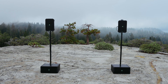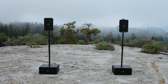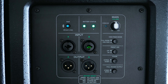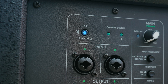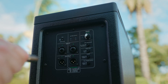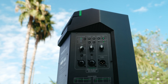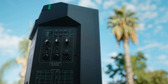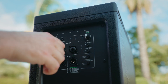It's also worth noting that wireless Bluetooth linking between boxes is only available on the Thump Go tops as a stereo pair. The Bluetooth on the sub is only for streaming directly in — there's no wireless linking capability between top and sub, or between sub and sub. That connection has to be made with an XLR cable. So if you're wanting to do a stereo pair over Bluetooth, just plan to update your Thump Go's, link them via Bluetooth like normal, then daisy-chain the Thump Sub Go's via XLR.